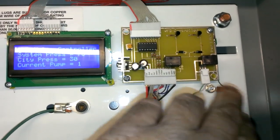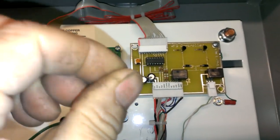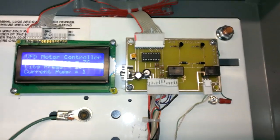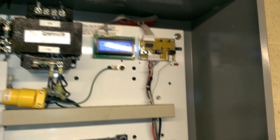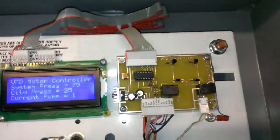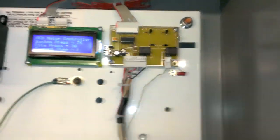I thought I shielded everything and thought it'd be okay, but it must be the style of this relay. The points must be really close to the 5 volt coil that's driven off the electronics — it was just spazzing it out. The little diode there was not able to suppress it. It suppresses the reverse polarity voltage spike, but there must have been some kind of little surge I was getting. Maybe putting a metal oxide varistor across the coil would have fixed that. I don't know. Anyway, it's labeled now.